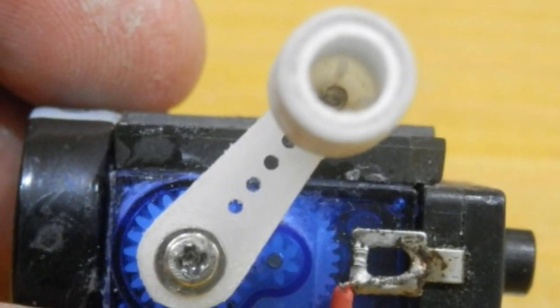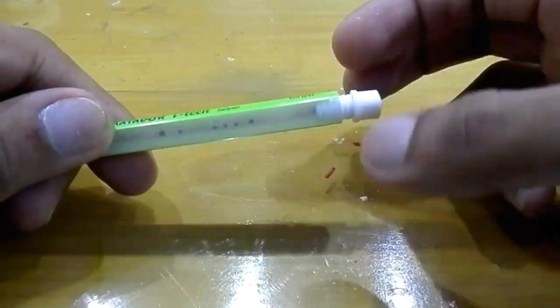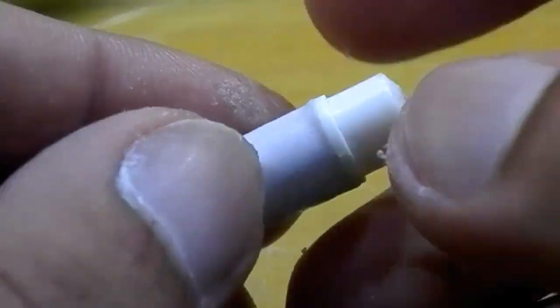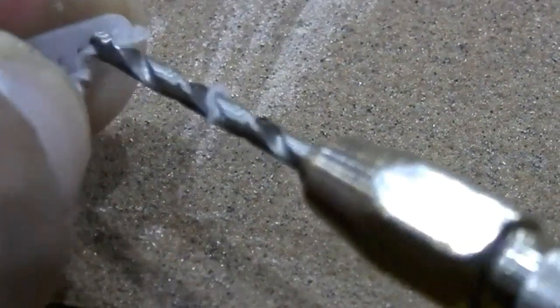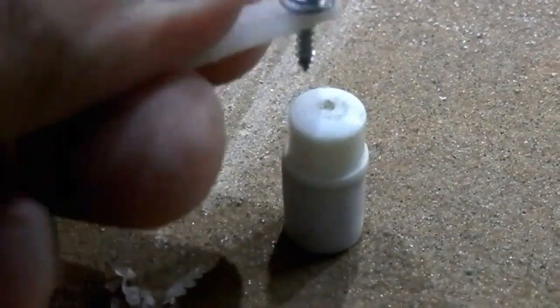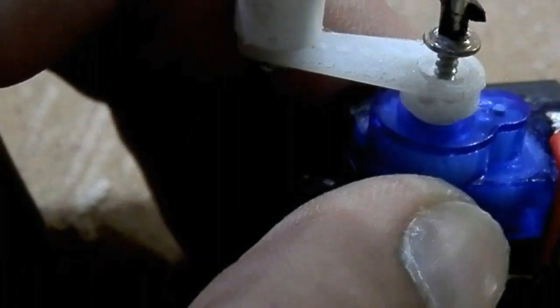Now the last thing we need to do is to make a hand crank. For that I used a simple pin's bottom part. To make it comfortable to crank I used a piece of paper, then glued that and sanded it. I took a servo arm and manually drilled it with a drill bit which is a little bit bigger than the screw I'm gonna use. Then I used the screw to hold that in place. Make sure it's not too tight, then screw the entire thing to the servo.